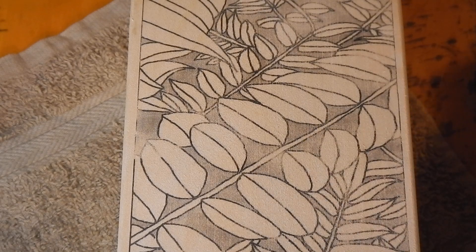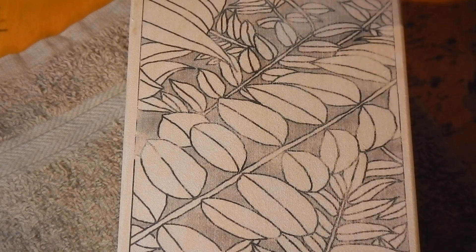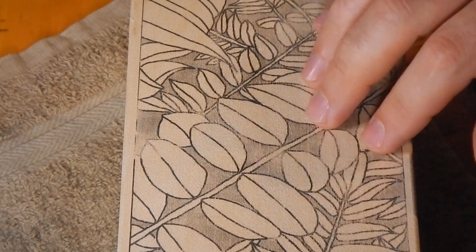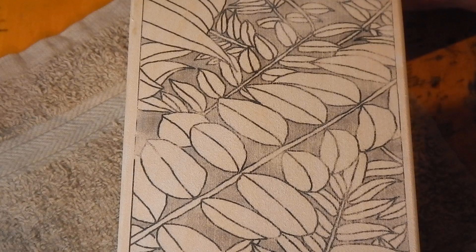While the tool is heating up and you're printing, another tip is the darkness to print at. If I'm making a pattern using pure black lines, I'll print it at 70 to 80 percent opacity. That gives a good balance between being dark enough to come off clearly on the wood so I can see what I'm doing, but also makes it easier to remove any remaining pattern lines after I'm done. If you print at 100 percent opacity — full black on the wood — that can deposit more than you need, and erasing those lines after you're done can be a headache. Especially if you have any fragile areas, you don't want to be erasing any harder than necessary. So I try to balance that at 70 to 80 percent opacity on a black printout.